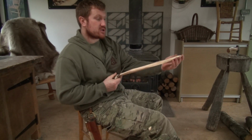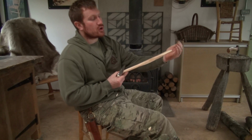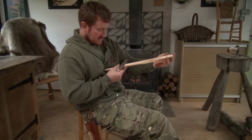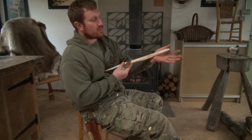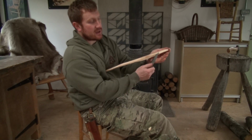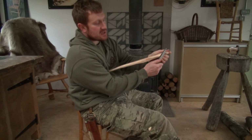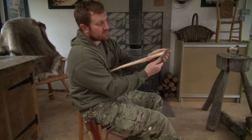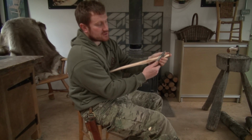The next grasp we want to show you is what we call the finger push grasp. So this is mostly designed for when you're cutting tight curves and you want to work back with the grain. So what this involves is, again, the piece of work resting against your body as a backstop, and then we hold the workpiece with just our thumb and forefinger, leaving these three fingers on this hand loose so that we can then apply pressure on the back edge of the knife and we can steer the knife round that curve. Now the safety is that we're applying pressure with those fingers, and as soon as we get to the end of the stretch of our fingers, the knife effectively stops.